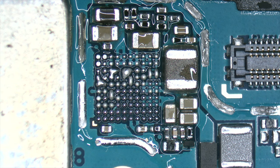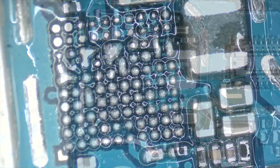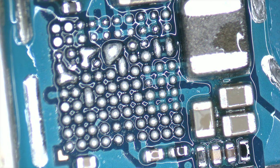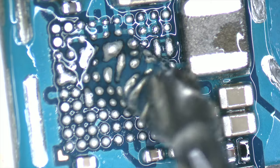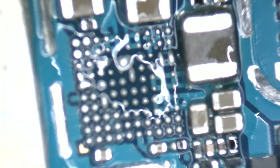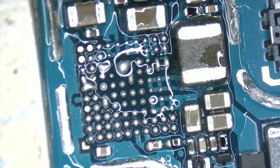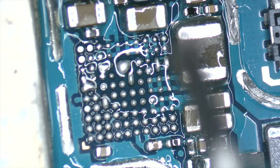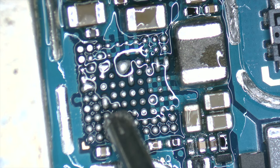It's only necessary to maintain a temperature of 380-400 Celsius degrees and lower the airflow to 20%. In this way, the small capacitor will not move. On some occasions, you can even have repairs in your workshop with more than 20 components moved from other workshops. These are the easiest repairs to carry out, since it is only a matter of correctly placing the moved components.